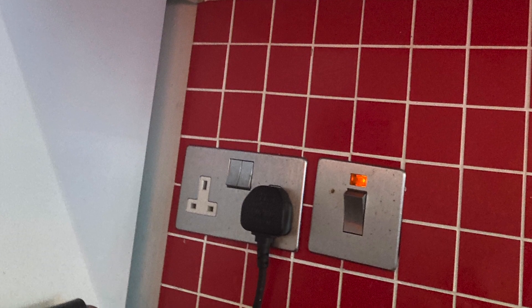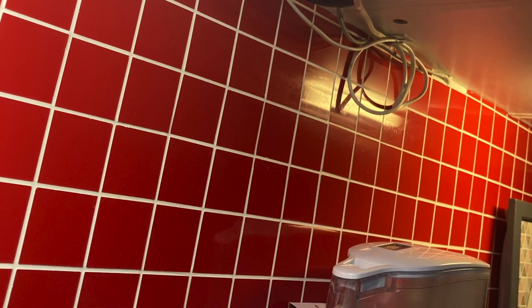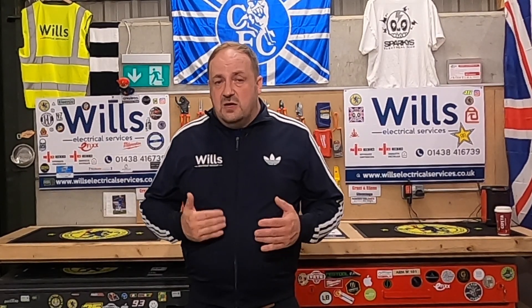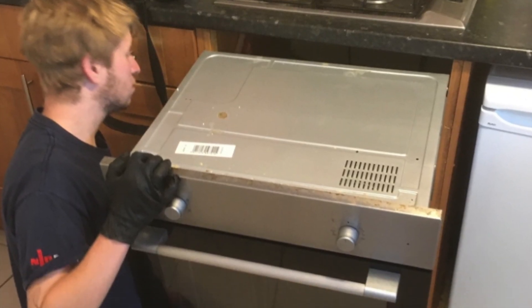A good observation in the kitchen is the plinth lighting. It's a nightmare because a lot of kitchen fitters used to just feed them from a switch fitted underneath the cabinet straight out of a socket unprotected — that's always a nice one to look for. Usually the actual connections in them are absolutely garbage as well.